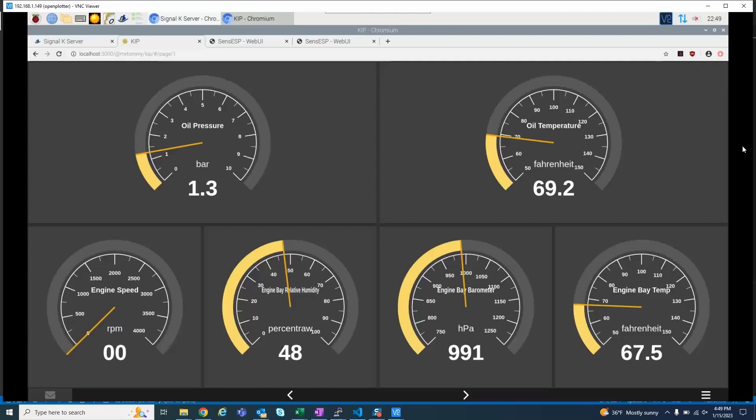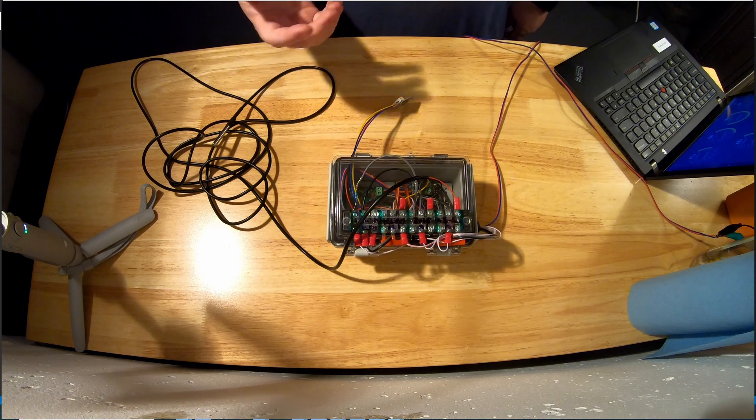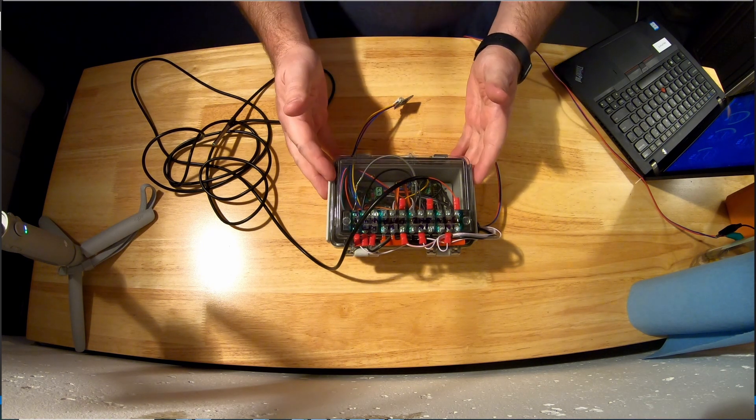Looking at the screen — to make it easier I decided to create a KIP window that had the gauges so we could see just the devices. If I take the environmental sensor and breathe on it — there you go, you can see that changes. Oil temperature is from the one-wire sensor, so if I grab the one-wire sensor that should change also — my hands are pretty cold, I've just been for a walk outside and it's about 30 degrees outside. The oil pressure is connected to this resistor here so it won't change — it's a fixed value — and the RPM is not connected up. But this is what it's going to look like on the boat. That's the end of the demonstration. Please like and subscribe — if you've got any comments put them in the comments below and I'll answer any questions. The next video will be about the install on the boat.